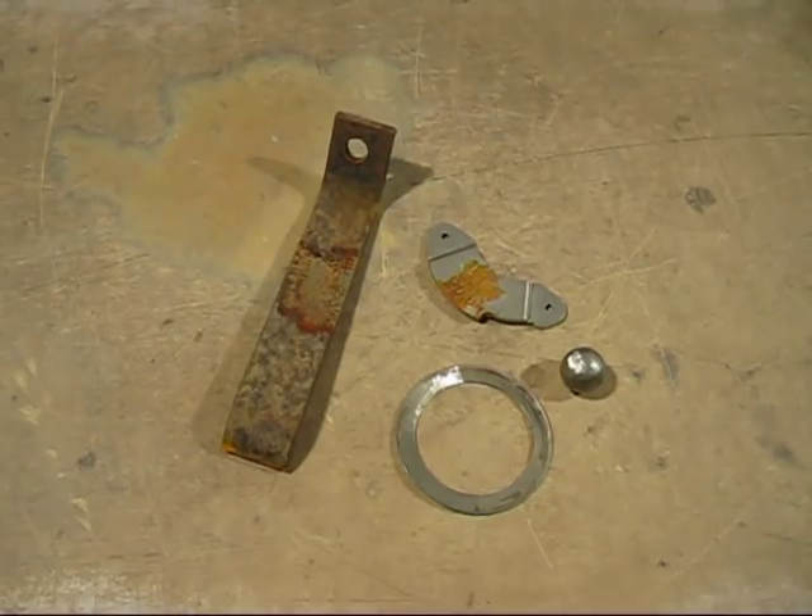One last thing — why did the castings and the wedge test turn out so good, especially when I was trying to break the ingots? Well, it seems that some cast irons might be suitable for this metal and it doesn't seem to affect it up to 1%. Also, adding steel to cast iron slightly lowers the carbon content and therefore raises the strength. So I might have got lucky this time — who knows.